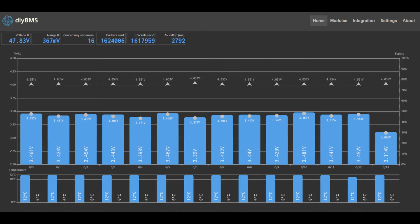The first 13 cells would all be sitting at about 3.4 volts but the 14th one would drop sharply down to about 3.1 volts, and so the pack would then be disconnected to stop that one going any lower than 3 volts. But obviously there's a whole load of power still in those other cells that could be used, so if I can get pack number 14 to be more similar to the other 13, I should be able to discharge them all more evenly down to nearer 3.1 volts and get better performance out of it.